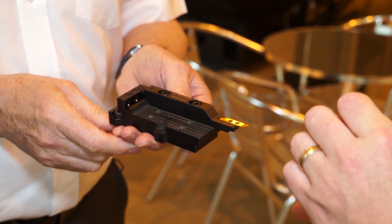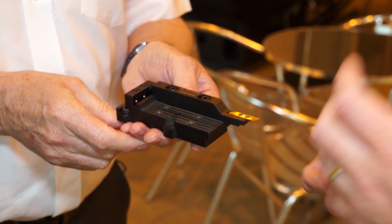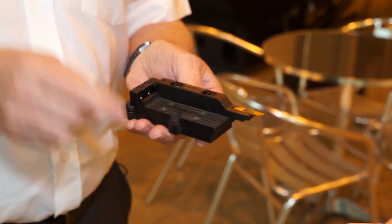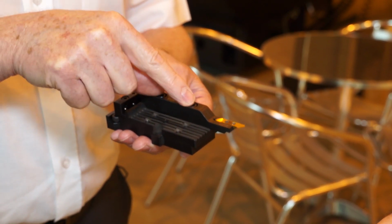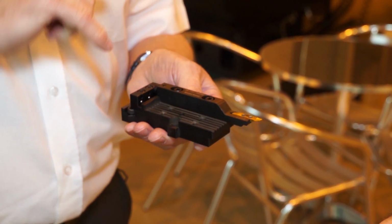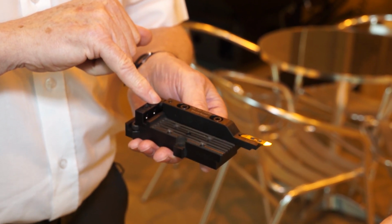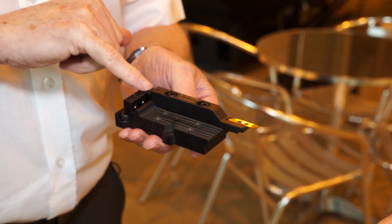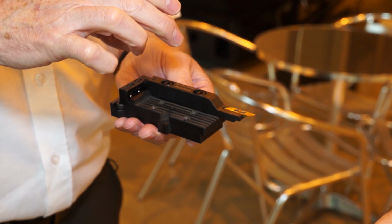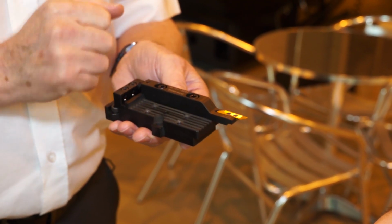Now what about actually the repeatability, and when you're taking the tool off and putting it back on, how does that work? Well, these screws through the shank clamp it to the base plate, which uses the Applitec patented ridge system to locate. This screw on the back acts on the register plate, so that is your preset dimension. So once you've changed the tool, you click it back on, screw it up, and it's exactly where it came off.